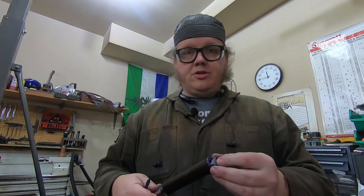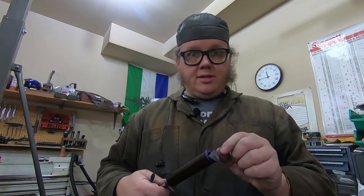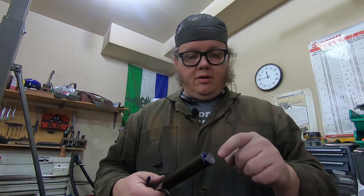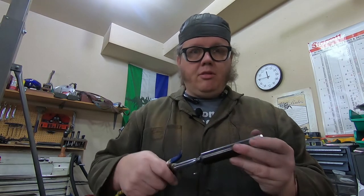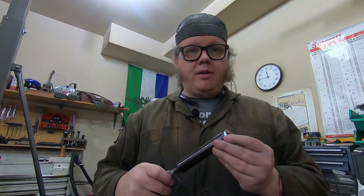This style of aperture seems to work pretty well, and I now know that I need about 1/4 inch gap between here and where the rest of the whistle shape begins. So the next step will be to machine all of this into a single pipe with another threaded insert on it and see if it works as a single unit. But I think that can wait for next week.